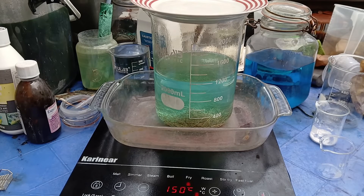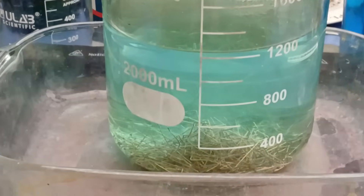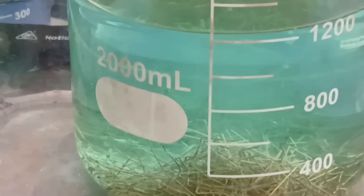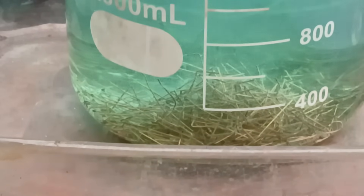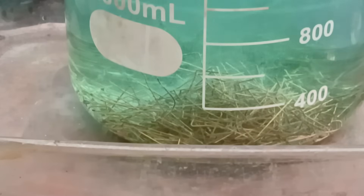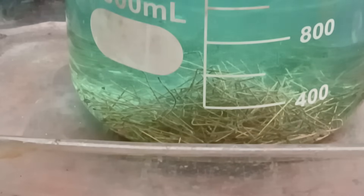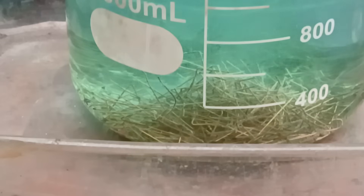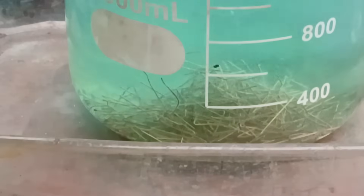It's been running about 10 minutes. You can see the coloration has gone to a bluey color - that's the copper being dissolved into the solution. We're getting some gold flakes beginning to come up on top, and a very active reaction at the bottom. I'm going to add a little more sulfuric acid now - about 20 milliliters - just to show you the reaction. It's starting to rain here which is a bit of an annoyance.